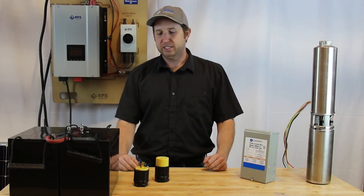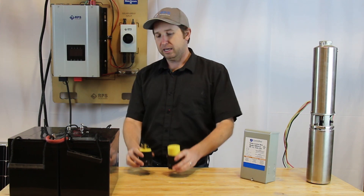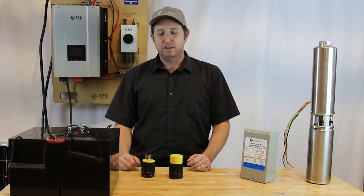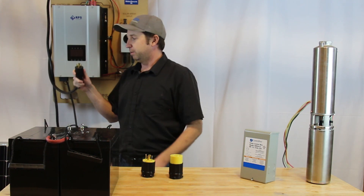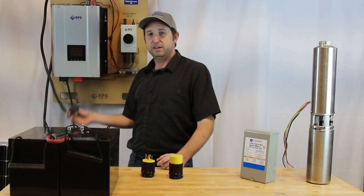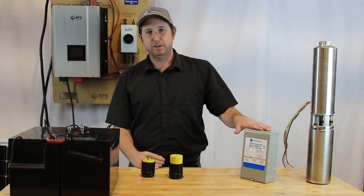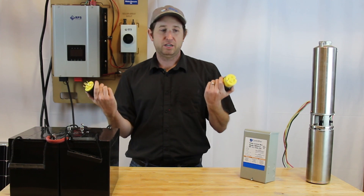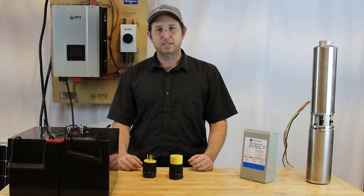Another common question is: can I set this system up myself? The answer is yes. We provide easy-to-use plugs, and WaterSecure itself has plugs so everything can be plug-and-play. It hooks in between the circuit breaker of your house — we plug into the 220 coming from the house, and then plug our load into here. It's basically an in-between between the breaker and your existing pump or control box. Once you have the plugs installed, you can do this yourself or hire an electrician. Everything else is plug-and-play.